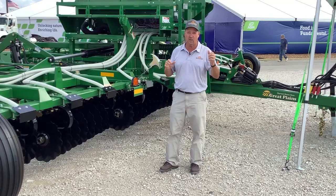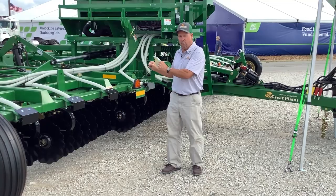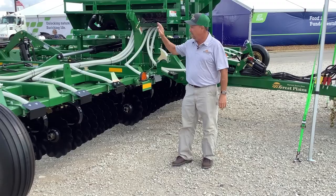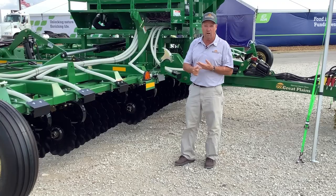If you're continually running that Turbo Max in that 3, 4, 5, 6 degree gang angle and you're wanting something that's just a little more aggressive — that's the Terramax. That's what we introduced this for. Something that's going to be a little more aggressive, it'll kill some weeds, it's going to take out those combine tracks, it's going to level the field a little better as far as smoothing the ground. And then it's got the double reel attachment on the back — it's going to give you an excellent seed bed.